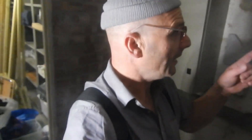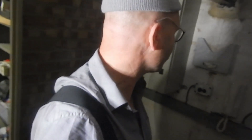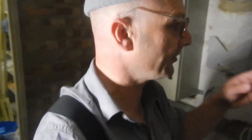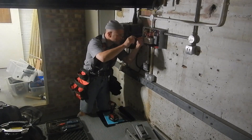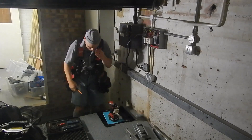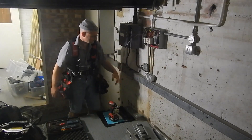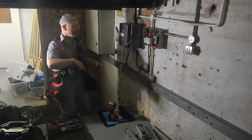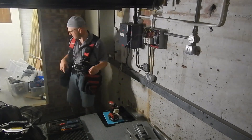Good morning. We're down in the basement, in the motor room - the lift motor room. And sure enough, I can't see a motor here. But there's a single-phase board here which we need to test. We've already looked at the lift main isolator here. We're going to test this single-phase board - it's got six ways. It's one, two, three, four, five, six. Car lights - so that goes to the lift light. All I'm going to do there is an insulation resistance test on it.